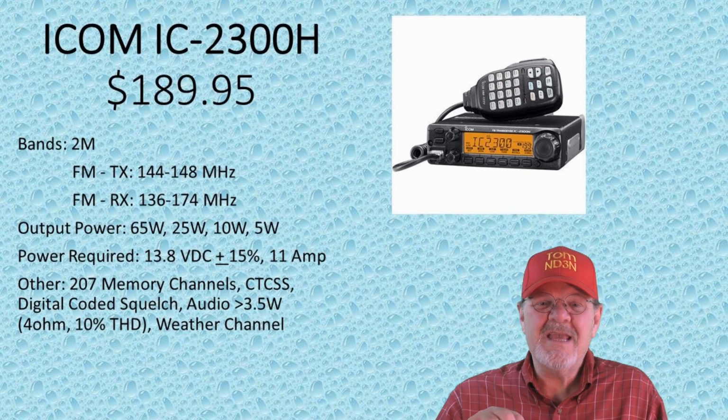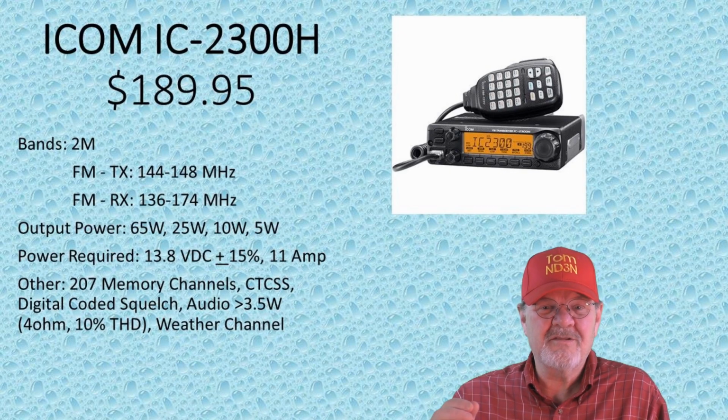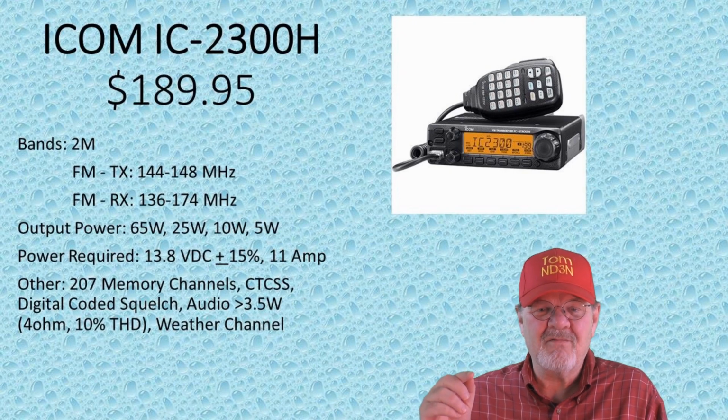Next on our list at $189.95 is the ICOM IC2300H. Like the Yaesu before it, this rig is a 2-meter FM rig with transmit between 144 and 148 and receive between 136 and 174 megahertz. Output power is selectable between 65, 25, 10, and 5 watts.